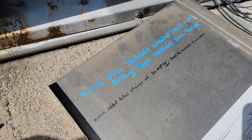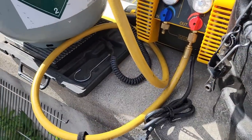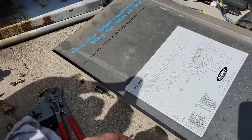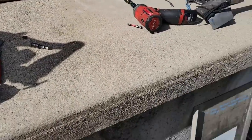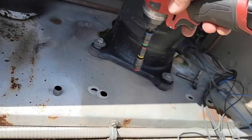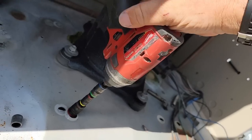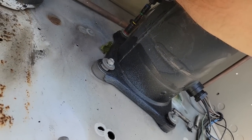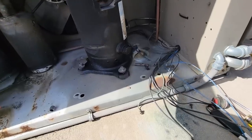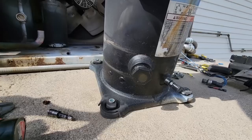She just left it out. 26 pounds and I only pulled out 15 or 16 — that's great, that's always good. So we probably have a leak too. But this thing started up in 2005, so make her last another day. That might have been those evaporators that were changed — they probably were old ones that were leaking. Now the problem's fixed, I hope. There we go, let's see if we can see that oil.